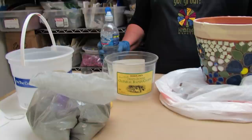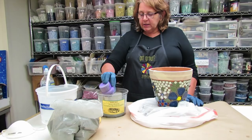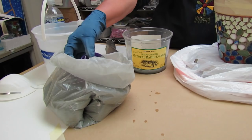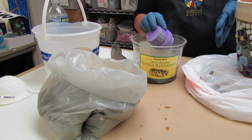Similarly with other concrete or cement-based products, I always like to put a little water in the bottom of my mixing container first so it doesn't get caked up on the bottom. Today I'm using sanded grout, which is polymer fortified — so it's good for the weather, stronger than unsanded grout, and it's made to go in spaces over an eighth of an inch so you don't get any cracking.